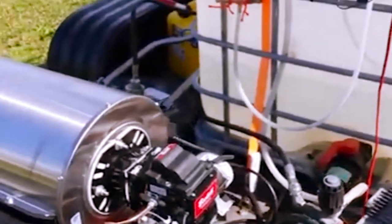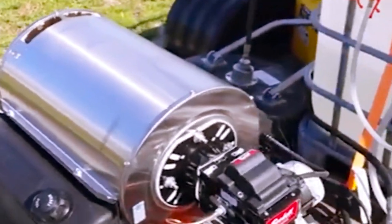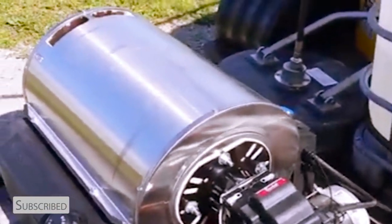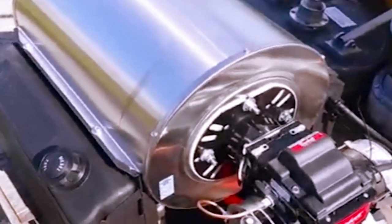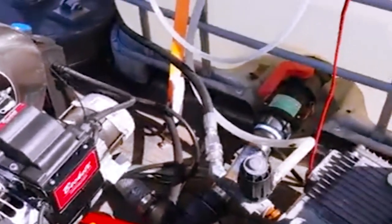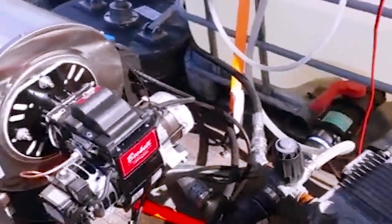We're redoing the trailer. I just picked up a hot link from Russ Johnson that goes with my four-gallon-a-minute machine, so I'll get about 200-degree water out of it. It's set up where I can hook up to the hot link, run straight cold water to the hose reel, or throw my downstream injector on there to pull chemical.